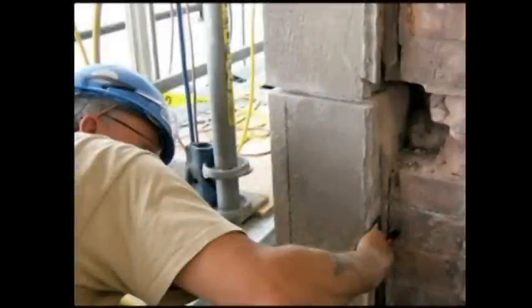This mason is shown carefully surveying the damaged area and marking for a square cut for the Dutchman repair area to a uniform depth of one and a half inches. Any loose or fractured stone is also selected for removal and planned out in the cutting out and removal process.